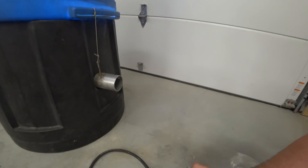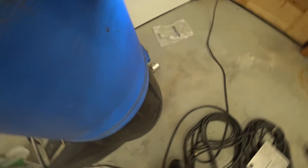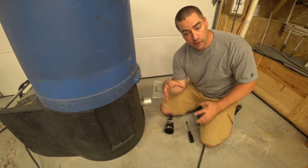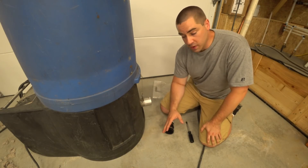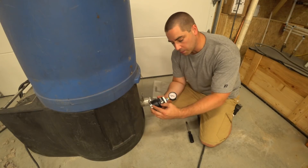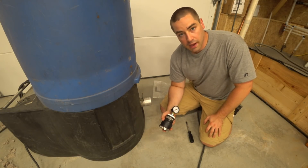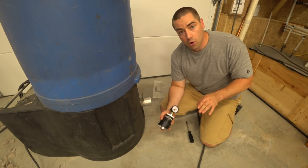All right, we're going to turn on the blower. All right, now we're going to turn on both at the same time. Now, the most important part to getting a good dense pack is air pressure. That air pressure is going to be a combination of two things: one, the seals of that airlock — how well it's going to trap the air and force it out of this port; and second, the blower itself. So you can test both things because all you care about is how much pressure you have coming out of this. I took a very simple setup — a rubber coupling, then a reducer, another reducer, and an air pressure gauge. This one goes up to 15 PSI. What you're looking for is a bare minimum of 2.8 PSI in order to do a dense pack. If it has anything less than 2.8 PSI, there's no hope in getting a proper dense pack.